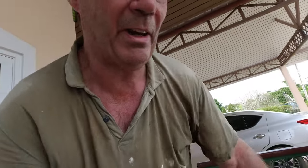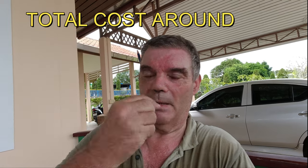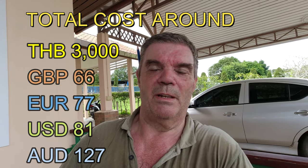Was it worth all that work for 80 watts? Rounding down to about 50 watts an hour, and the sun shines on that panel for six or seven hours a day — say six hours — that's 300 watt-hours a day of free electricity. I'll put up the prices for the 80 watt panel, the inverter, all the pipes and bits. All said and done, it's not a lot of money to pay out.